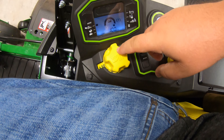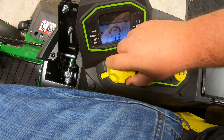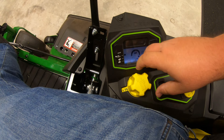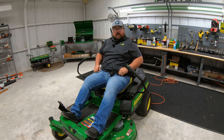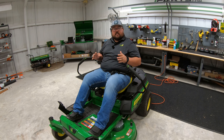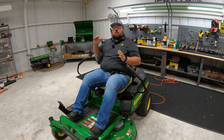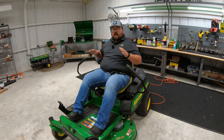There is also a foot-adjusted deck height. Use the foot pedal along with the height selector knob at the controls: press the pedal, turn the selector to the desired height, then let off the pedal to drop the deck to that height. To raise it back up, press the pedal again, adjust the selector, and let off. Keep in mind there is no transportation lock on this mower. When transporting, going over obstacles, or loading onto a trailer, set the deck to the highest position — four and a half inches. Cutting heights range from four and a half inches down to one and a quarter inch in quarter-inch increments.